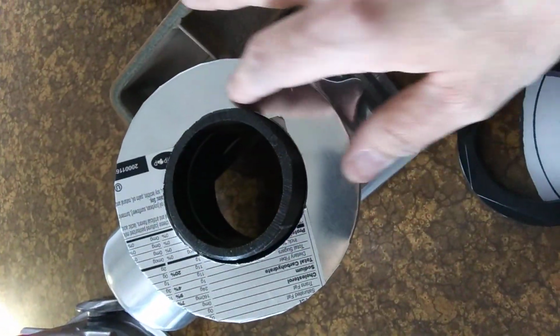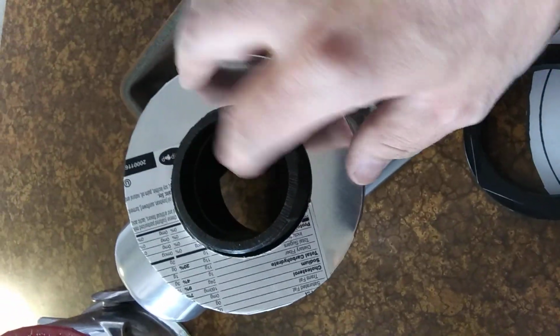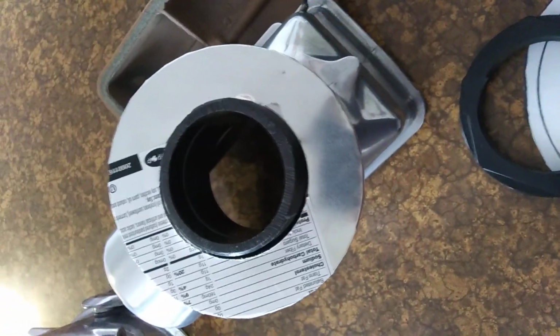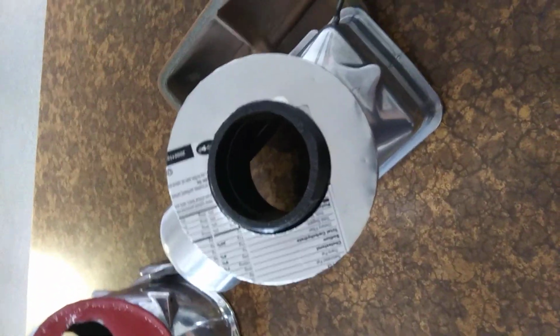It's not too bad. It just takes a little patience, and you want to definitely be careful. Like drilling this, for instance, with a hole saw, you almost want to do it in reverse, the hole saw in reverse, because otherwise it'll catch and you could cut yourself and have all kinds of problems. So be very cautious, you guys.